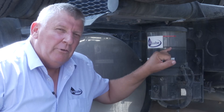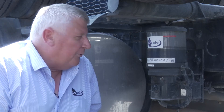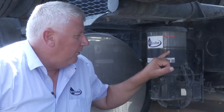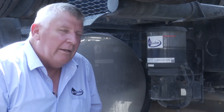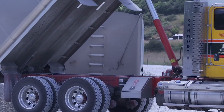The follower plate is a great development. We're not the only product with a follower plate, but it's certainly something a customer should always look for, because the follower plate allows you to keep all the moisture, air and dust out of the grease. It shows the grease level very clearly and allows it to stay clean — which is what you want. You want everything clean and sealed, one complete closed system.